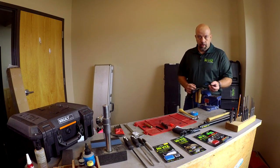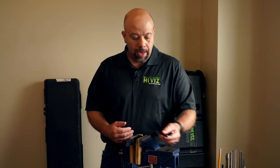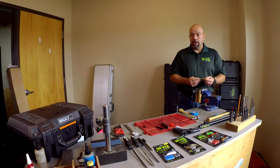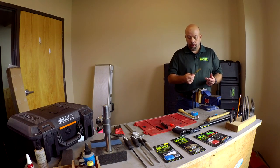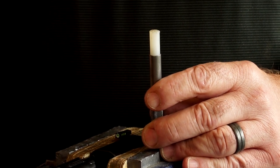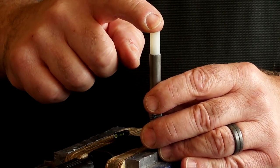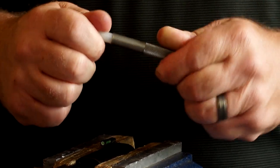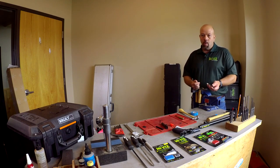I did use a steel punch to remove the other sight, but I highly discourage people from using a steel punch to install the new sight. We have a lot of options for punches. You can use a brass punch, but keep in mind that brass will often transfer to the sight, so I usually put tape over the tip to protect it. When I install sights, if they're properly fitted, they don't need a tremendous amount of pressure to drift them into place. I prefer to use a nylon tip punch — this one has replaceable nylon tips that simply unscrew out of the punch. It will take more force to drive it in, but if it's fit properly, this will still be adequate to drift the sight in place and you won't hurt or scratch the gun.